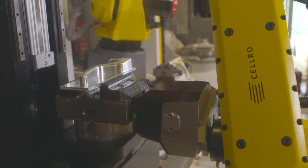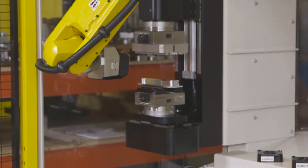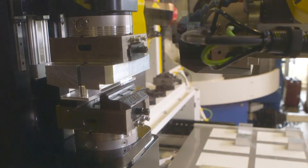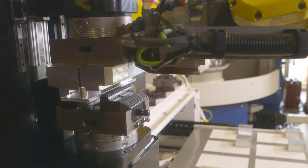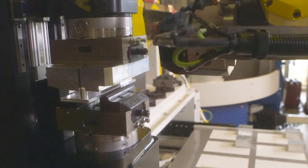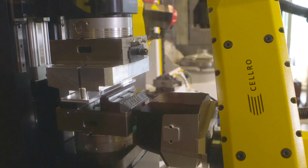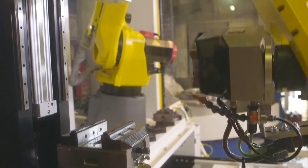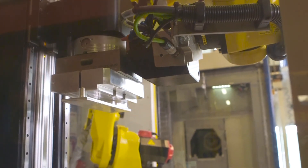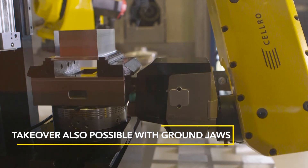Docked in the lower station. As you can see it's not released yet — the clamp is still under force, under pressure. It will rotate. You see the air-controlled docking of the top station over the product. The robot module has been rotating 180 degrees to clamp the centric vice on the top station. Now the piece is double clamped. The lower station will be released, after which the top station gets back to its home position, controlled by air. And again 180 degrees to take over — ready for second operation.